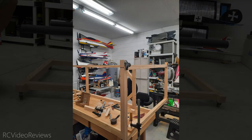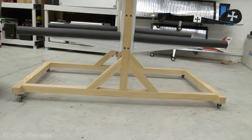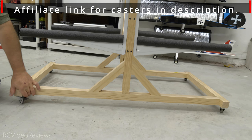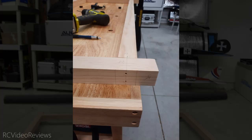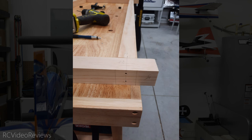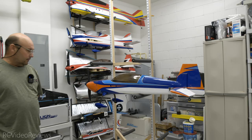Four casters were added — probably three-quarter to one inch — with little foot brakes, all from Amazon. We'll put links for those casters in the description. Wood screws were used throughout, but every single one was pre-drilled with a pilot hole to prevent splitting. Every single one — you have to do that or the wood is going to split. If you're doing rough construction you might not worry about it, but every one of these was pilot drilled.